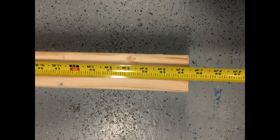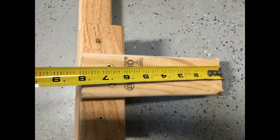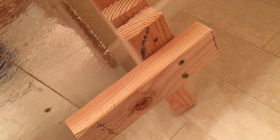This is the bottom piece. It's going to go as the skirt down on the other side of the tub. Those wood pieces there are going to wrap around the tub so we don't scratch the tub and it gives us support. So if they lean into the wall, these studs will push in but not go all the way in. And if they pull with the grab bar, these stop them from pulling the wall towards them. We're going to sandwich in some foam to keep it from scratching. You can use shipping foam or anything that will keep the wood from contacting the tub part. That way, when you take it all apart, just put your shower curtain up and it's back to normal — you don't have to call a repair service to fix your tub.